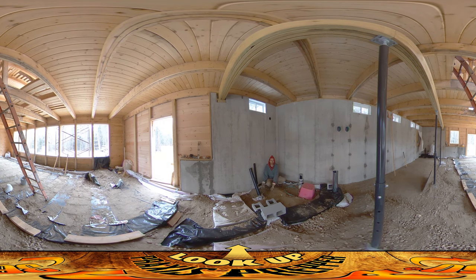Maybe they were running short on pipe material or whatever. They made them kind of squatty, and when I actually really looked at it they're going to be below the slab. So if I poured the slab they were going to need a jackhammer or a drill or something to get down to these pass-throughs, and clearly that was a problem. So I contacted them — like, was that your plan, what's the deal with that — and it became obvious, yes, that was a mistake.